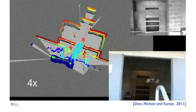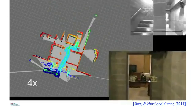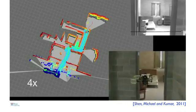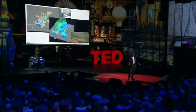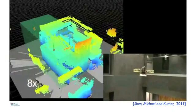The robot figures out what the features are, builds the map, figures out where it is with respect to the features, and estimates its position a hundred times a second — allowing us to use the control algorithms described earlier. The robot is being commanded remotely by Frank, but it can also figure out where to go on its own. If I were to send this into a building I knew nothing about, I could ask the robot to go in, create a map, and come back and tell me what the building looks like. The robot is not only solving how to go from point A to point B, but figuring out what the best point B is at every moment — it knows where to go to find places with the least information, and that's how it populates the map.